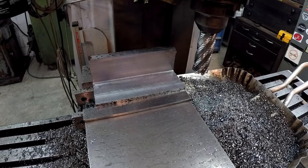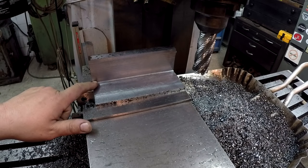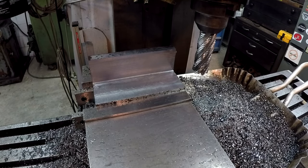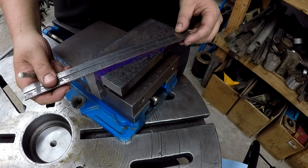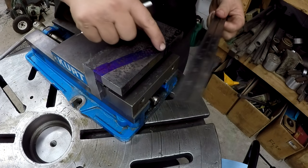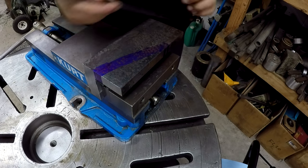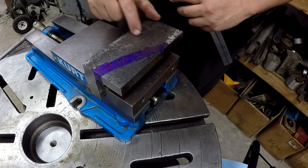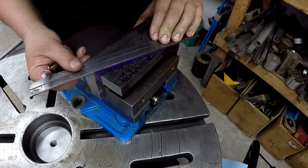I'm happy with it. Of course we still got some other features to mill into it — we've got a slot to mill, an angle to mill across here, and a hole to put in it, though I think I'll do that after it's all welded together. I just used a blue Sharpie to lay out a line I can indicate parallel with. I've got a line inch and a quarter from the bottom of the plate where it starts, and two and a half inches in from this side — that'll be the width of the main body, the two plates I welded together.